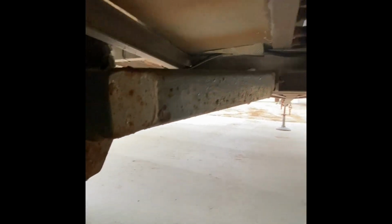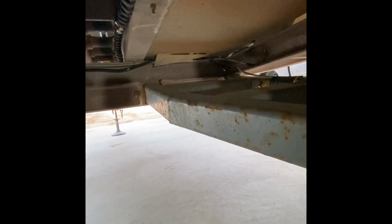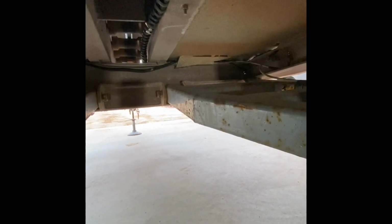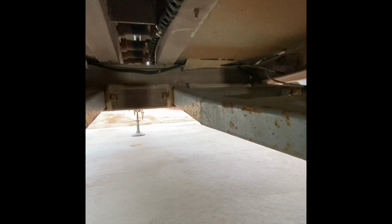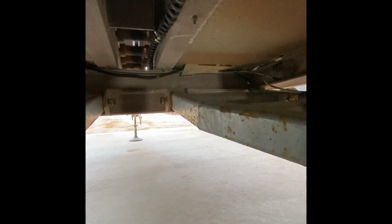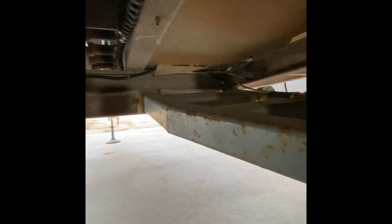It's 6mm thick swing arms. They're 6mm thick, fully. I built these myself, all plated. That's all 12mm thick gusseted. It's all cross-membered, and I run 79 series Land Cruiser bushes, which run a 19mm high tensile bolt as a pin. You can run greasable shackles, but I found I don't need it.